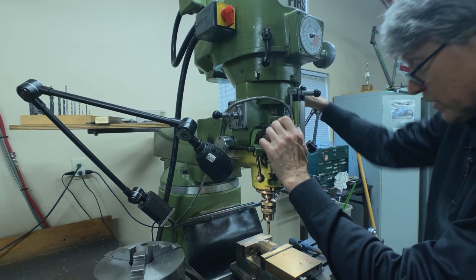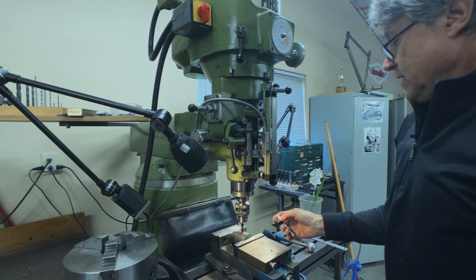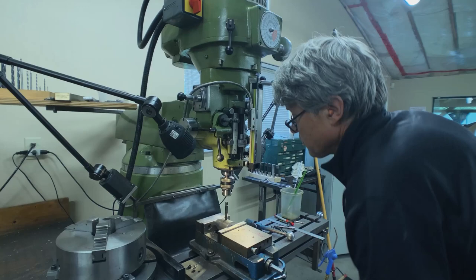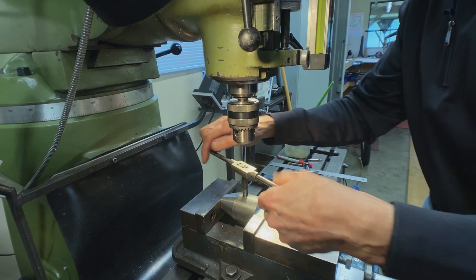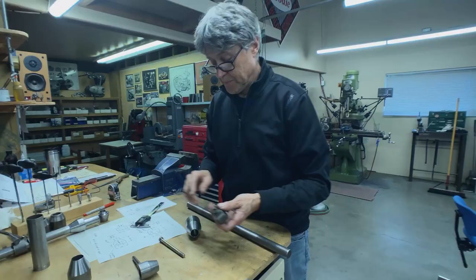Here we go — I'm going to start the motor, switch it off, and then bring down the tap. I didn't have to use the brake. The tap has started in line with the drill — it's perfectly in line because nothing has moved. I'll go grab a tap handle and finish off the thread. I can just wind it down and I can feel it going through into the bore. That's our thread. Then we've got one more operation in the lathe.